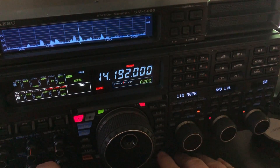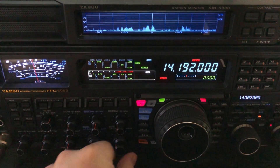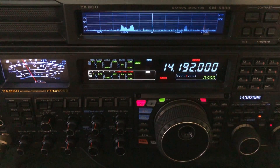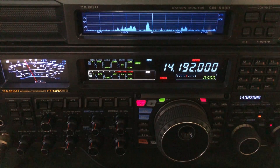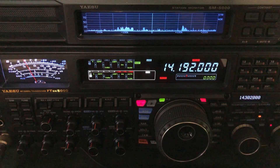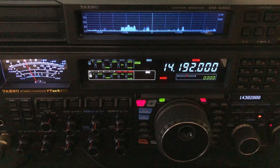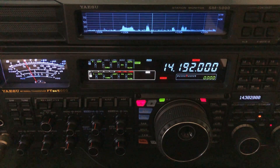Let me illustrate that. Look what's happening on the S meter right there — let me turn the volume up. So I'm going to turn the noise blanker off and you'll see now I'm just back to that grind. If it's power lines, that comes and goes sometimes, because what's causing that — believe it or not — is the lack of moisture in the air. The voltage on the power line components builds up and then discharges when it gets high enough, it'll literally arc across the air. The drier the air, the higher that voltage builds up before it discharges.